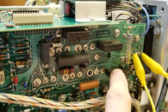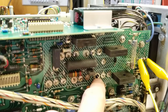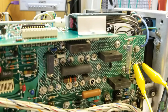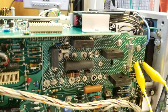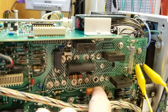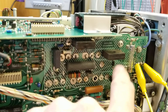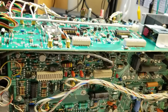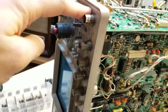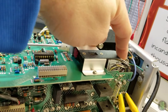Removing either component is going to be absolutely brutal. The capacitor has four posts — the outer ones in a triangle are all tied to the can, and the center is the positive lead. Desoldering this is a nightmare; I'm having to heat it to the point where I'm starting to see the trace lift off the board. To remove it from the other side I'd have to remove this board, and to do that I think I'd have to remove the faceplate, with all these interconnectors between boards.